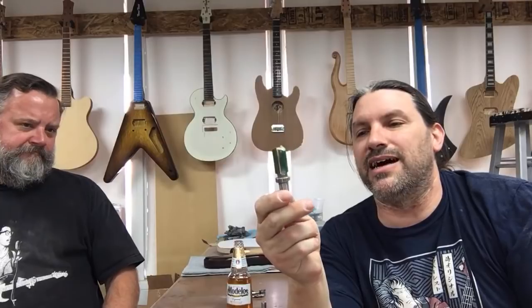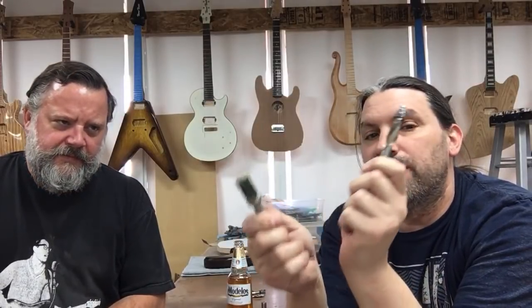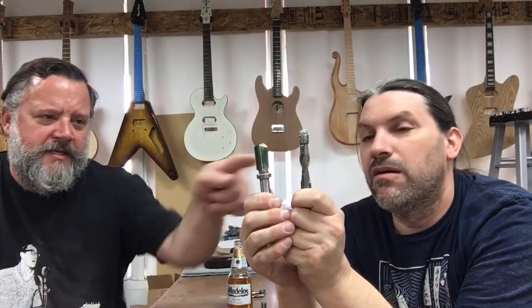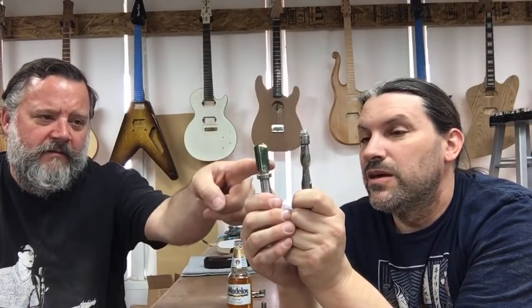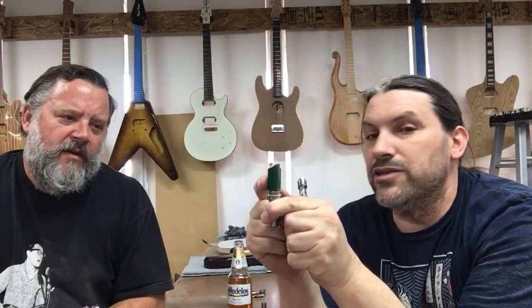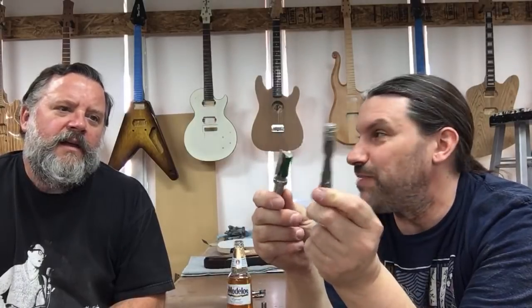I want you to look at two bits here. This one was probably about $30, and this bit here was $99. Why is this one more expensive? A regular bit is steel with a carbide edge, and you can't attach carbide in a spiral. So this bit is made entirely of carbide — that's why it's more expensive. That's why they call it a carbide spiral bit.